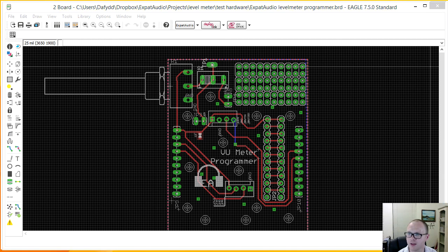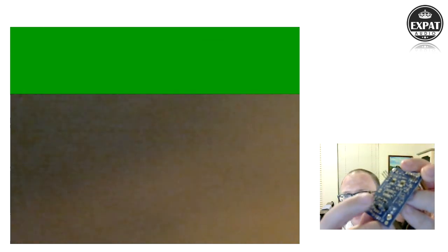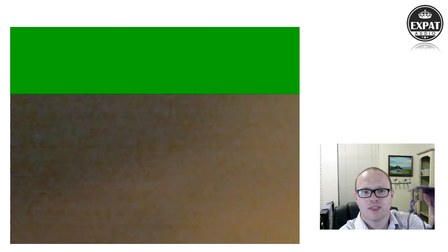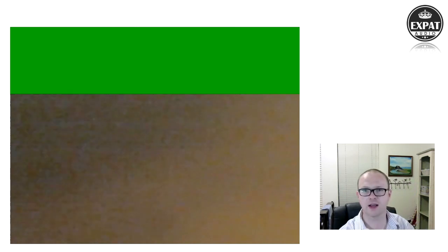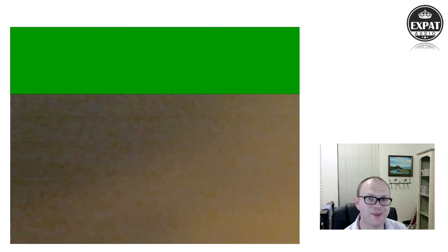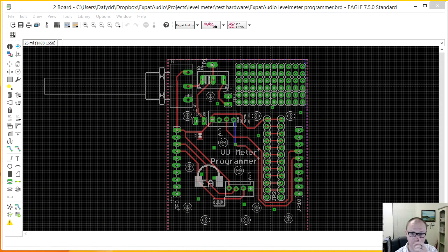I just realized that some of you who dialed in last week may have seen what I was talking about, but if not, let's see if this works. Pardon the whole screen for the other camera. For instance, these are pogo pins. What you're looking at here is an early version of the Eden test board that we have. The Eden is a microphone preamplifier that we sell at Expat Audio. It has springy pins that are brought out to a power supply, an input signal and an output signal, and a pot to control the gain. All that goes in and out of the audio tester that I have, and I can set up gains and so on. That was two, maybe three years ago when I developed that. I've learned a lot of other tricks since, and I'm hoping to integrate those into this board.